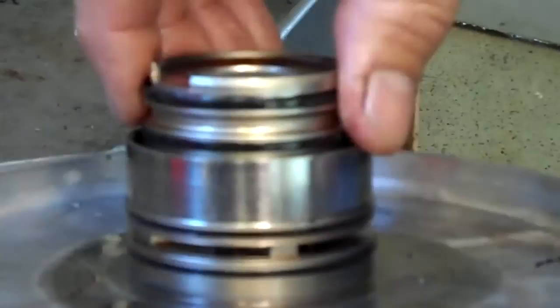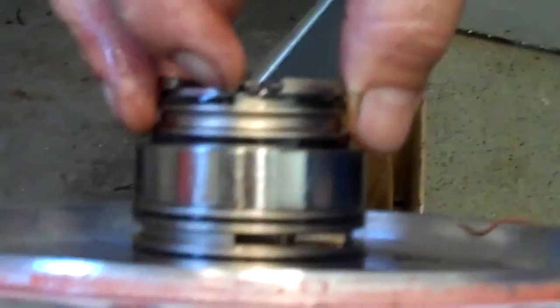Here's the initial problem: there are four sealing rings and they're supposed to fit nice and tight with no slop up or down. But this one, the case is worn out and it just falls right off, bleeding off all the pressure right there.